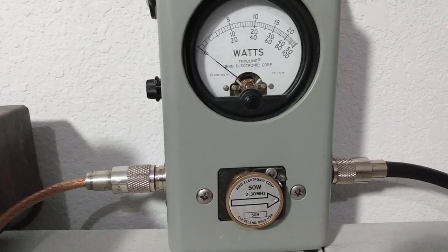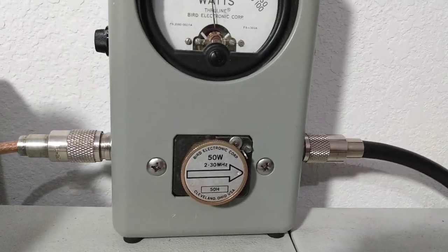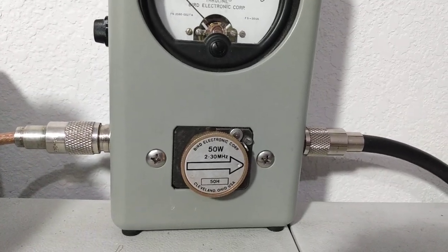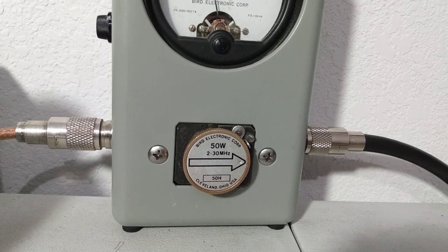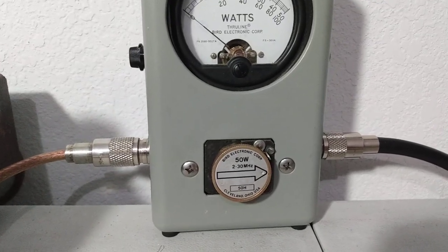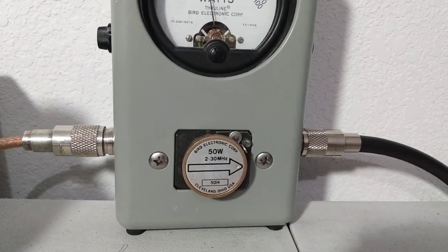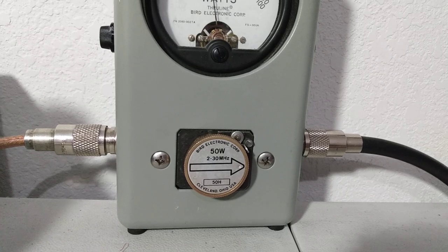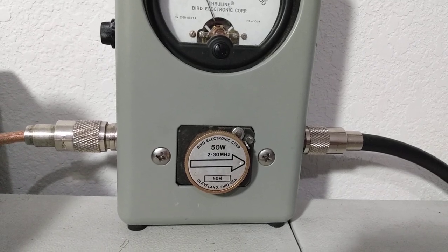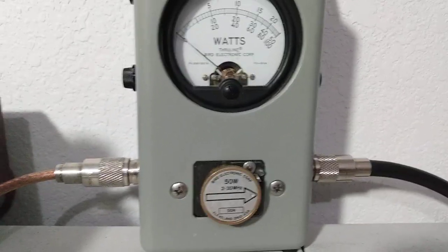And now we'll go all the way down. Hello, 15 watts average. Just talking into the mic. Hello, radio. We got our mic gain at 2 o'clock. Let's come on up to 3 o'clock. Hello, radio. Audio, 1, 2, 1, 2. Audio in about 15. And hello, radio. Just talking about 12 watts average.